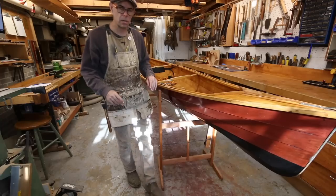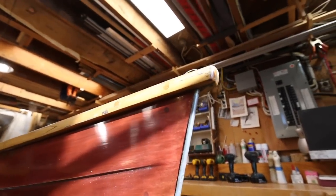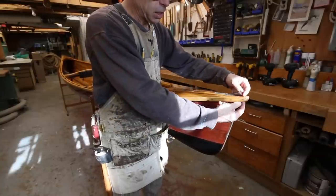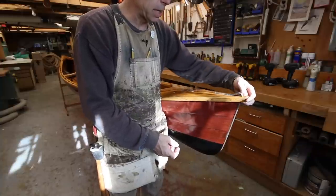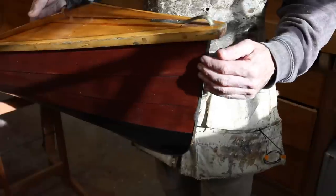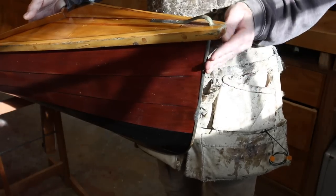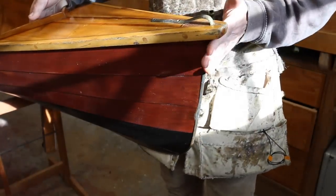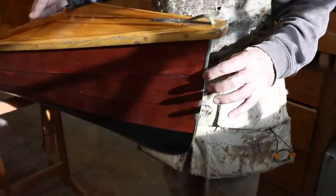There's a few spots where I probably shouldn't have done what I did. One of those is here, where I've got the stem band running around the outside and passing through the gunwale construction, so the gunwales sandwich over this stem band. The reason that's bad is it's very hard to seal where metal and wood come together — water tends to work its way in. You can see how the stem band overhangs the planking a little bit; I didn't get the planking oriented as neatly as I could have, and I probably didn't bring back the face of that planking enough. If I were to do this again I would have put a hardwood cutwater on the outside before the stem band.